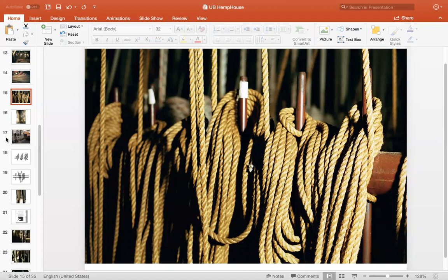But we would call up the rope vendors and order a specific Becker number. We would try to get it somewhere between 45 and 50 if we could. The other stuff was prohibitively expensive. It was used for decoration uses elsewhere. And the lower stuff was used for old hawsers and anchor lines and things like that that didn't get handled as much. But the stuff we wanted to be fairly pliable and not have a lot of slivers in it.